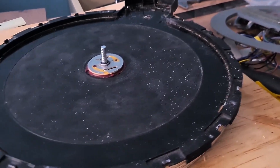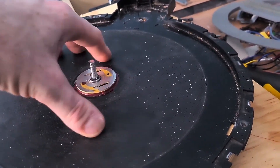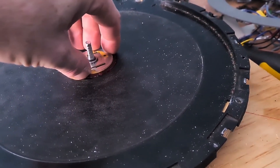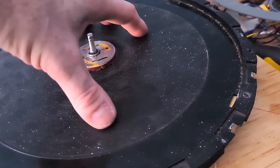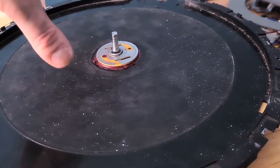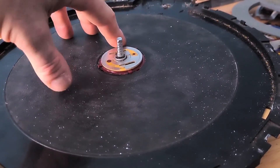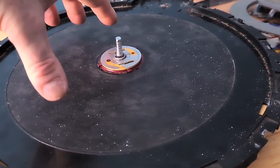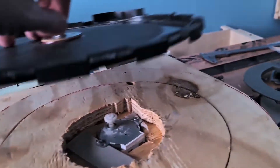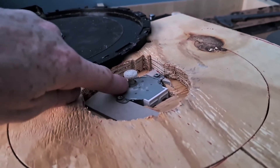The problem I've got here now is the base in the center is moving, and there's quite an awful lot of flex in the center of this turntable. Although I've got the motor speed right, I still don't like the fact that it's turning ever so slightly — and what's happening is the cog underneath is either riding over the top of this cog or underneath it.